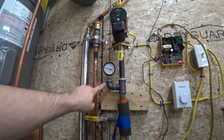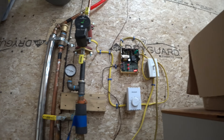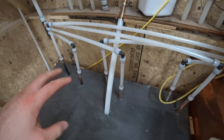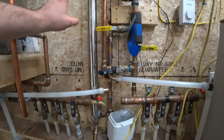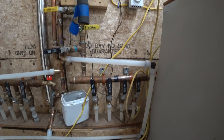It comes out through the expansion tank and through this Grundfos Alpha pump — we're holding good pressure. This is where the temperature sensor is that connects with the controller. This then goes through the heat exchangers. These three copper coil heat exchangers are in parallel, and then it joins back up to this manifold, goes to the bottom, through the air vent, back down to this manifold and down to the radiant floor.